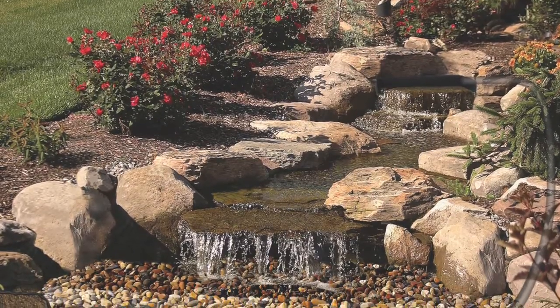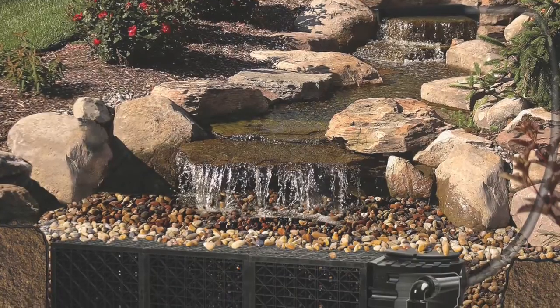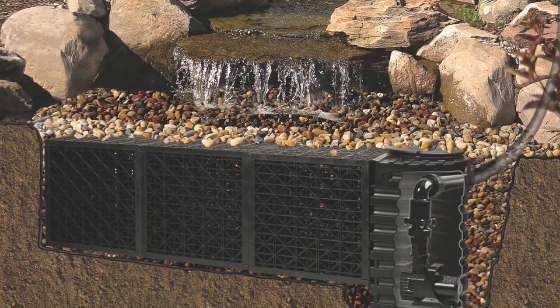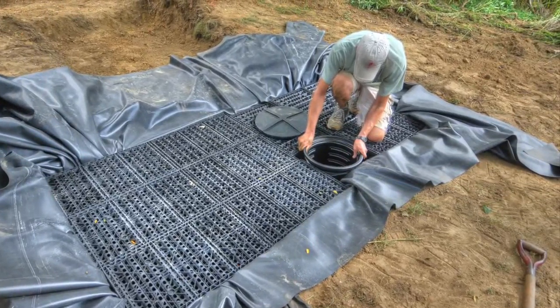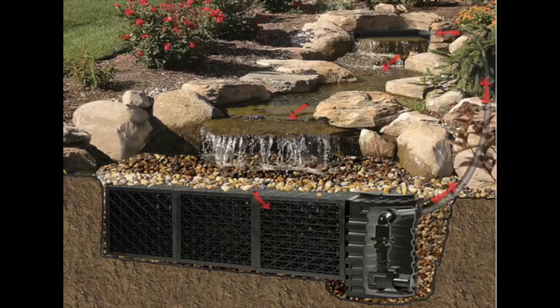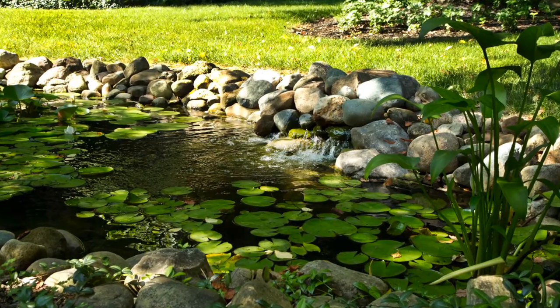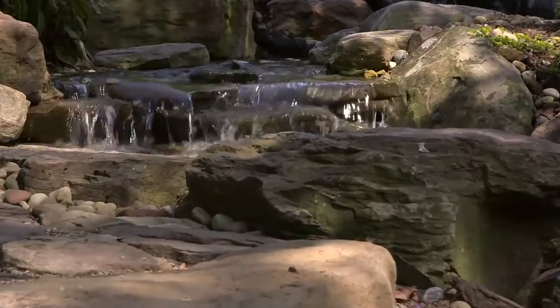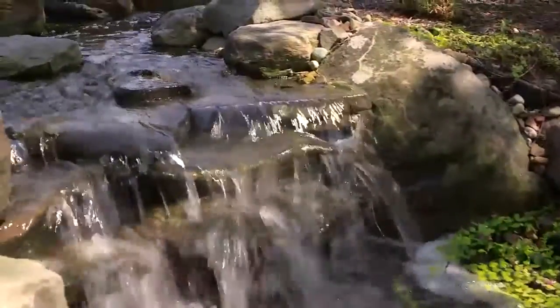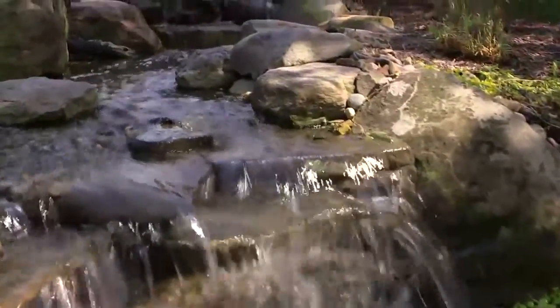When it comes to installing a pond-free water feature, you would typically start at the heart of the water feature, the pump. Pumps are usually placed inside of a protective pump vault located in the lined reservoir. This pump takes water from the reservoir and continuously pumps it back to the top of the waterfall. These water features can be turned on and off at any time without worrying about an ecosystem like a traditional pond, and this can also help in managing operating costs. When choosing a pump, you will need to consider the flow in gallons per hour, the amount of head height in the waterfall, and the wattage of the pump.